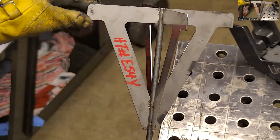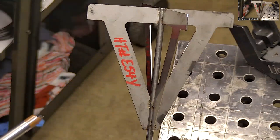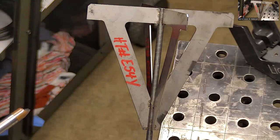The critical welds are going to be the ones on the donut, the cylindrical shaped one, because that is a float, so it has to be sealed. Got it. It has to be airtight. Okay, no problem.